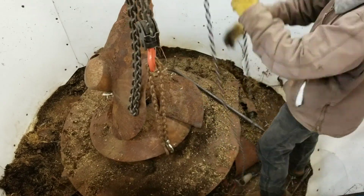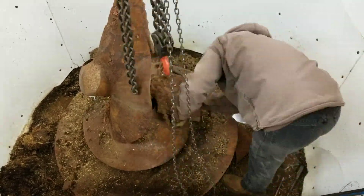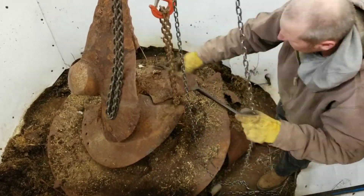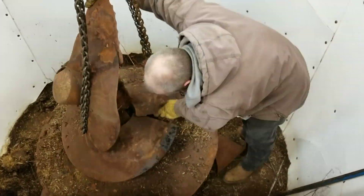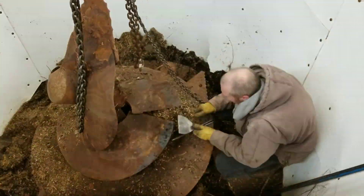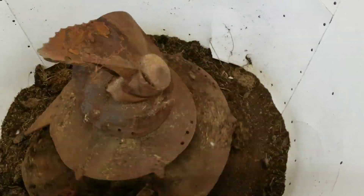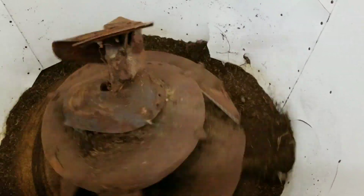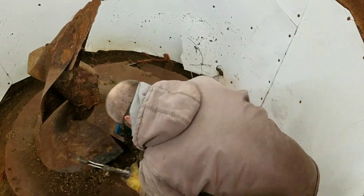I'll speed things up here as I try to straighten out the upper section of the auger, using the overhead chain hoist to try to pull the flighting back up into position and straighten out the upper center section of the auger. As we're straightening things out, I'm also cleaning out a lot of the debris that was trapped underneath the flighting, working that out of the tub and out the unload conveyor.